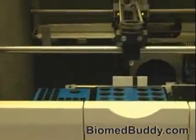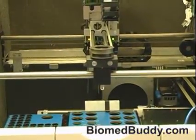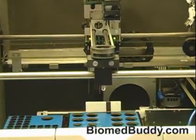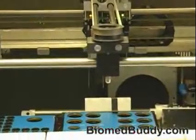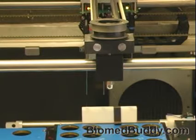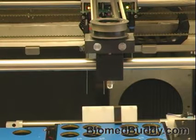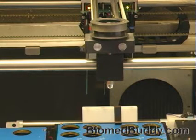Let's go over to the instrument and look at the needles. We're going to put 20 pulses in needle number one and hit enter. There's our 20 pulses. The fluid is coming straight down — it's not flaring off to the side, it's going right into the well. The well didn't overflow, which is a good thing, so the vacuum must be at least halfway working. We're going to do the same thing for needle two: 20 pulses. It comes out at a little of an angle, but that's not a big concern. If it was a minor quality control issue that might be a hint, but that doesn't look too bad.